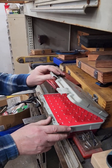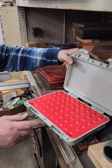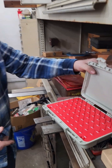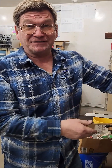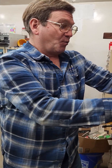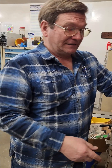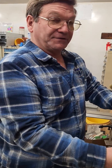We looked at some of the bigger pin gauges before. Here are some smaller ones. The thing with pin gauges is they make them in plus and minus. If you're using a plus pin gauge, they're slightly bigger than the size listed. If they're a minus, they're slightly smaller. You use these by trying one size and then the next one to figure out what size the hole is. It may not tell you exactly, but it'll get you within a couple thousandths.